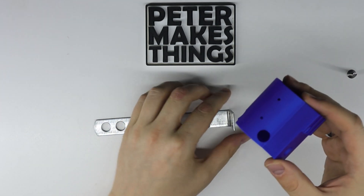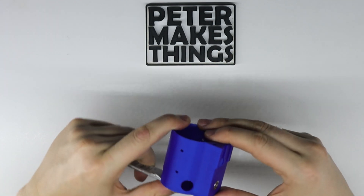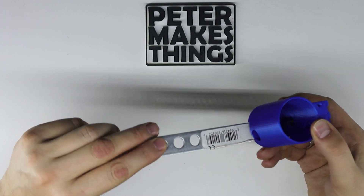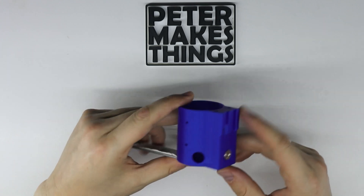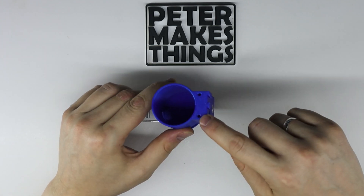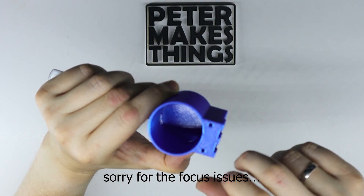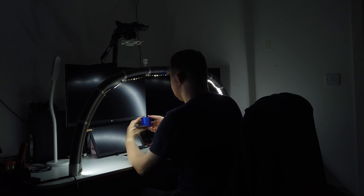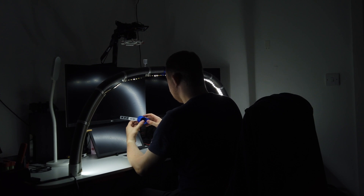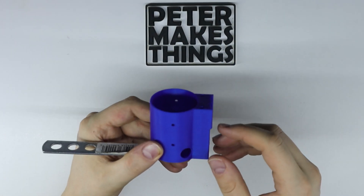After putting the cramp inside, you lock it with M5 screws. The holes here are aligned with the cutouts in the cramp, so you slide them in and use the M5 screws. Inside this piece there are cutouts for the M5 nuts, so it all holds nicely in place. Then you use the clamp to lock the steel cramp on the edge of your desk. On the top there are two M3 screw holes for connecting to the 3D-printed arc, and on both sides there are additional screw holes for the self-tapping screws that hold the pipe insulation in place.